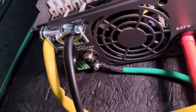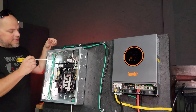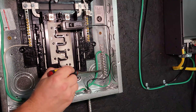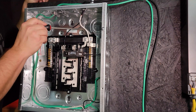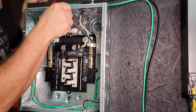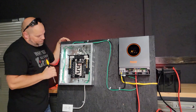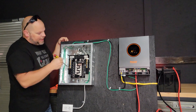To ground this unit would be here at the bottom, and because I did not want to create an additional ground-neutral bond in this box, I had to add an additional grounding lug on the side. So essentially what I've done was disconnect the neutral and the ground bond. Had I added a ground in here, the ground and neutrals would have been tied together — and that's something I didn't want because I've already got one ground-neutral bond and needed to separate them.